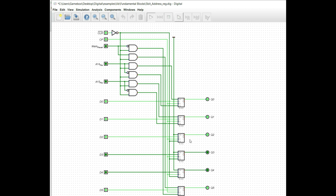So now that we have an idea how to create a register that will access both RAM and ROM, we have essentially the start for a larger system, a larger memory mapper. Now we're going to need 4 of these in total, because again we're using 4 windows, each of which can access a variety of different pages of memory. You could use this all the way up to 512K SRAM or ROM. So knowing that this is a single 16K window, we're going to need a total of 4 of these registers, and the construction of that is what we're going to be taking a look at next.